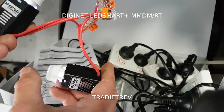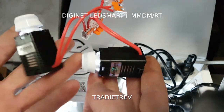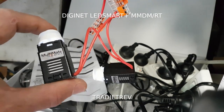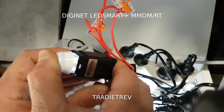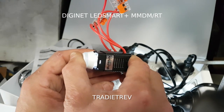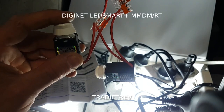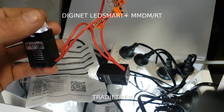See how that failed on the minimum brightness - because the kickstart function isn't set. At that very low setting it won't fire up. So same deal: hold it down ten seconds to enter setup. Kickstart is four times: one, two, three, four. Turn on - lights up - then click to confirm. It rapidly flashes. There you go, that's the minimum brightness turned on.